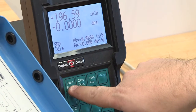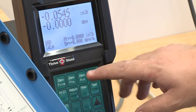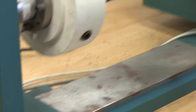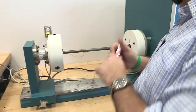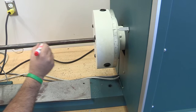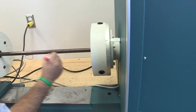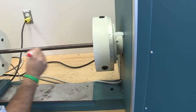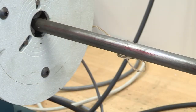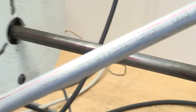Let's go back to the handset before we start the test. You also need to zero the torque — it says 'zero torque,' so I'm going to say zero. And then zero position, which is already zero, but you can zero that also. We're ready. I'm going to draw a line on the specimen because when it spins, it's really nice to see that line spinning on the surface. It doesn't look very nice on steel, but on aluminum it looks really nice. So you have a line on this side and a line on the other side.